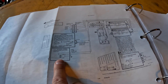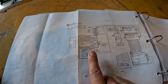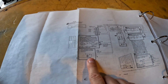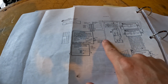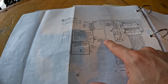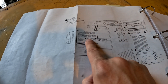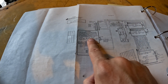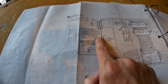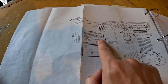Here is the external power transformer rectifier — that is the piece we replaced the other week that definitely went bad on us. Following the DC part, that's pin three right here, it comes up and ends up over here at the warning light controller. But it gets blocked by that diode so it doesn't go that direction at all, but that's important — I'll come back to that.